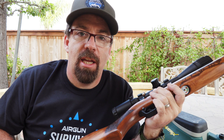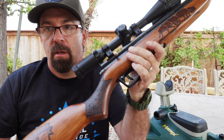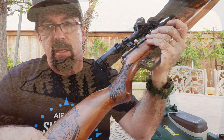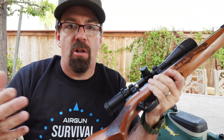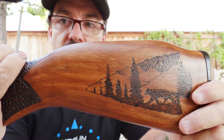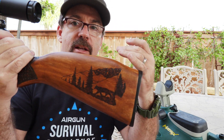With all my artwork done, I took some light sandpaper — probably about 300 grit, 400 grit — and some 4-0 steel wool, and I started buffing everything out all over the wood just to take off all the high spots and clean up my art a little bit. Once I got everything cleaned up, I went back with one of my nibs, whether it's lining or shading, and I just tightened everything up — tightened up all the edges, all the contours. Did a little bit more shading, and I knew once I stained it that it would really make the artwork pop.